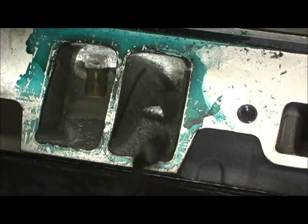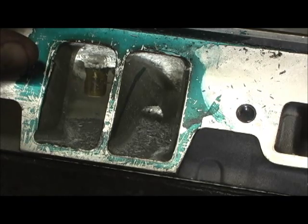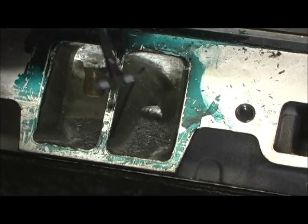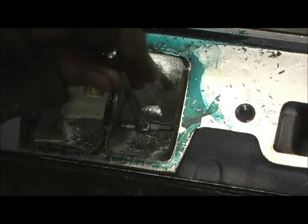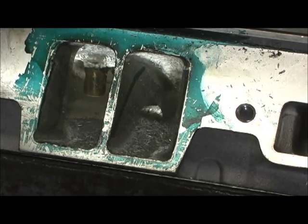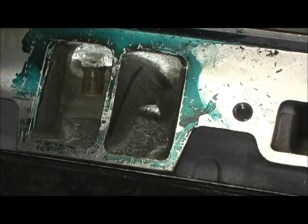That's what I want. Now I'm going to come back with my straight pointer, which doesn't remove near as much material, and get that wall perfectly straight — probably move it about another 20 thousandths under. You've got to be real careful and real slow right here, but this is a majorly critical part of it. I've still got some on the bottom half; I got the top clear. I work on the bottom and try to get it all level. This right here is no doubt one of the most important parts. I would love to just tear that whole wall out, but you can't because you'll go into air and have to weld, and we don't want to bust through.